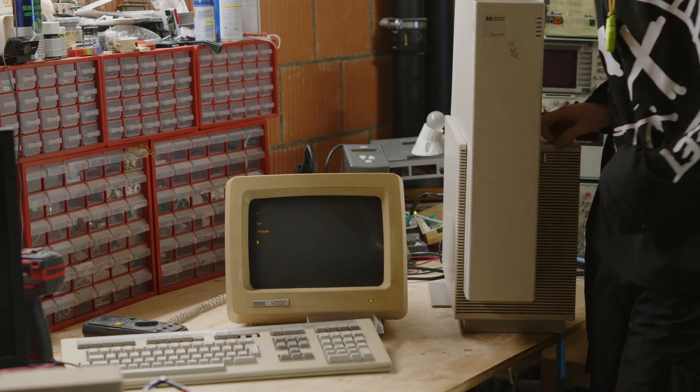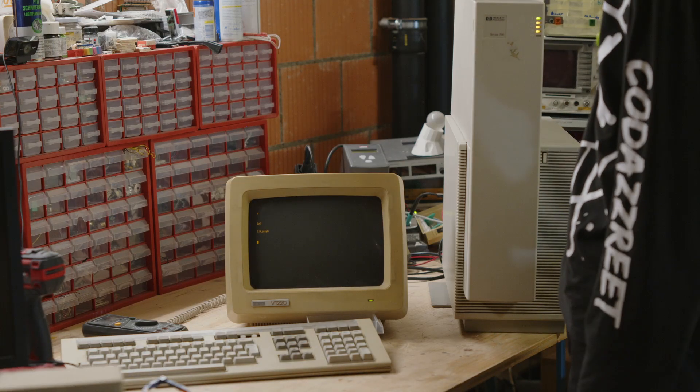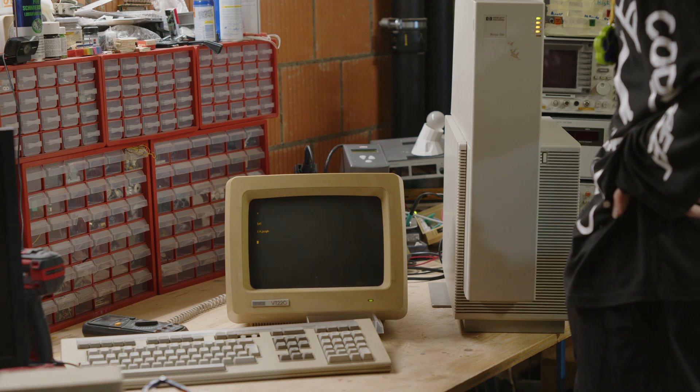Let's test my serial cable — pin 5 ground, and then the other ground will be here on pin 7. So I made a null modem cable, and possibly I just need to change the RX and TX lines. This soldering job is so ugly — holy shit, this is one of the ugliest soldering jobs I've ever seen, and it's made by me. Now it's still not pretty but at least a tiny bit less ugly. Maybe with the TX and RX lines changed it might be working. Let's try again. Nothing — with the TX and RX lines changed, still nothing. I may have to revert the settings, or let's just try the second serial port.